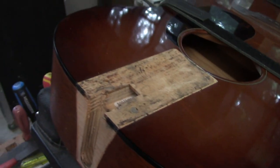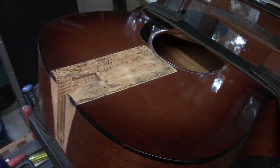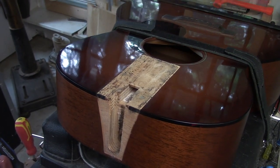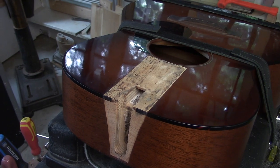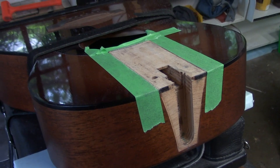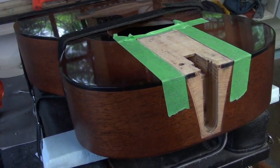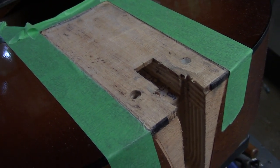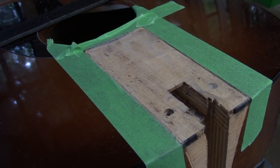This is what we ended up with on the top — no lumber, just glue residue. You do not want to bite into the wood here. Tape off the footprints so there's no chance of going onto the finished part of the top. A couple of things I want to point out about holding the body firmly while we clean up the residue of the glue — you don't want to alter that surface.